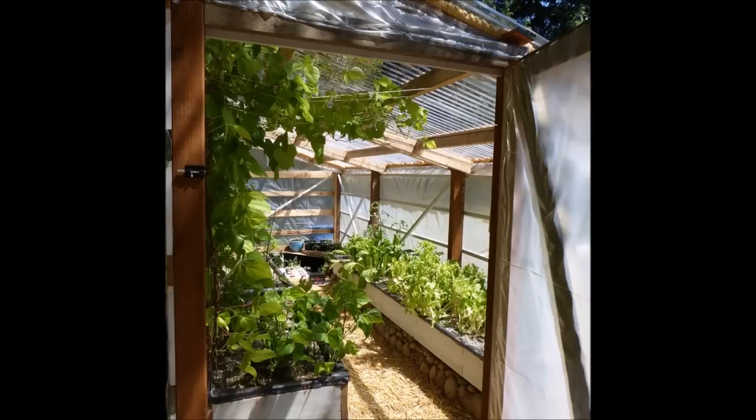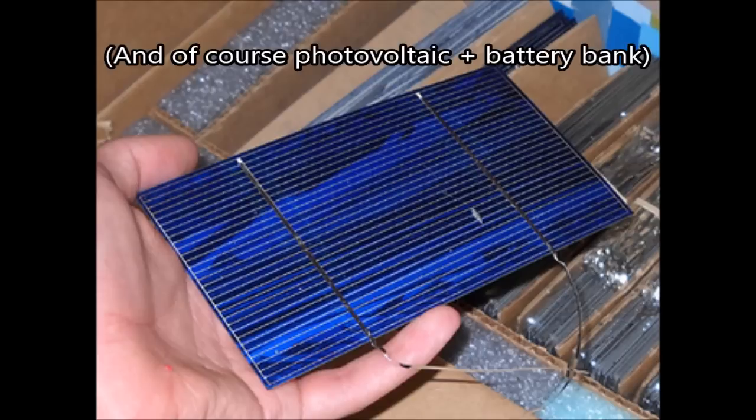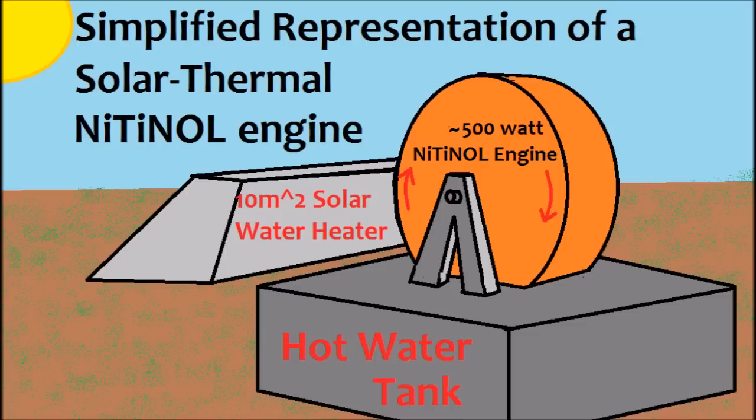I had thought about a few possible ways of storing energy for the greenhouse, including underground compressed air tanks using a vertical axis wind turbine to drive the compressor, and a large thermal storage system — basically a huge well-insulated tank of water, which is what I decided on. The idea is that there will be a solar thermal energy collector, basically a pipe inside of a parabolic mirror trough, and that will heat water pumped in and out of a large well-insulated tank in the ground to store the thermal energy.